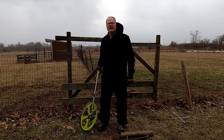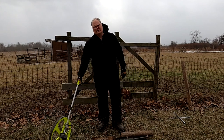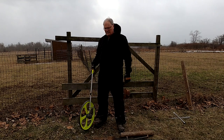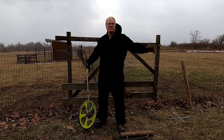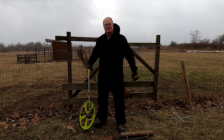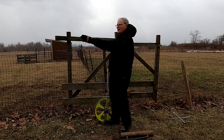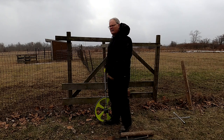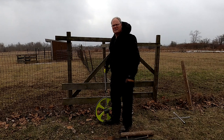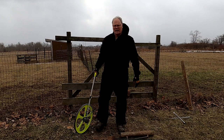How do you know that your fence is straight? How do you keep it straight? So once I measure off the distance, then I'll put in some starter posts about a third of the way, so like 100 foot I'll measure off. And then I'll tie a tight string between the two posts so then I know I've got it lined up right, and then I can look when I'm going 300 foot. You want to make sure it's lined up with the other far post at the end, otherwise you're going to have a zigzagging fence and it's not going to stretch right. So that's how I do it. I do it in sections where you have to eye it up to make sure you're right in line with the post you're trying to connect to.